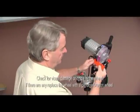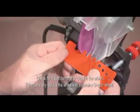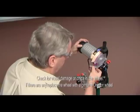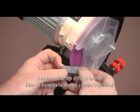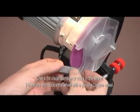Before grinding, check the shape of the grinding wheel. Do this with the plastic template and adjust the shape of the wheel with the dressing stone, both of which are supplied as standard equipment. Dress the wheel with a light sweeping action. You may use this same method to keep the wheel clean and in the correct shape in the future.